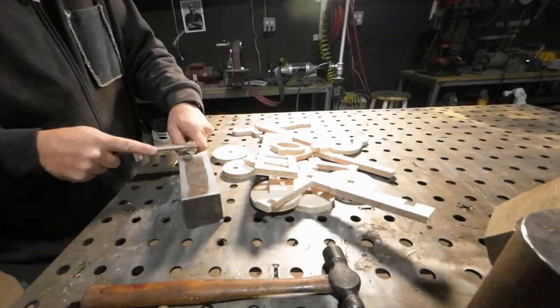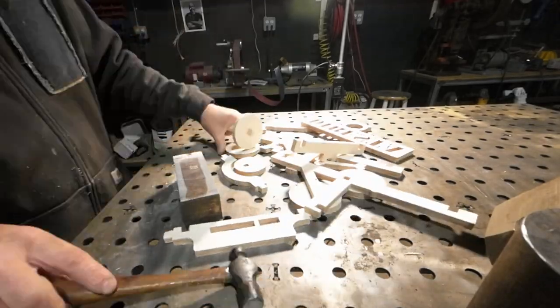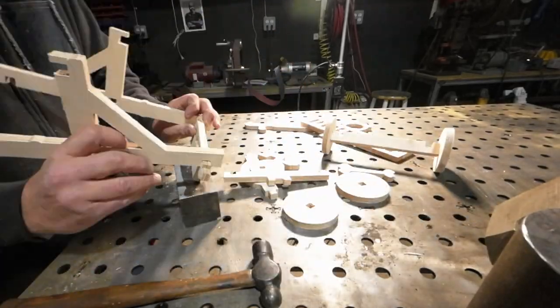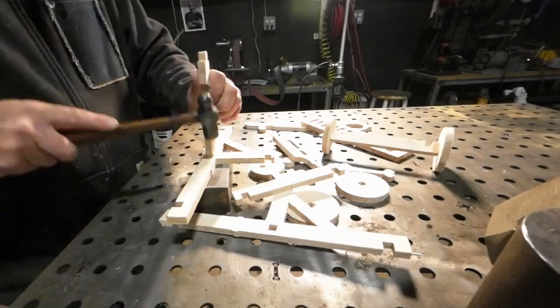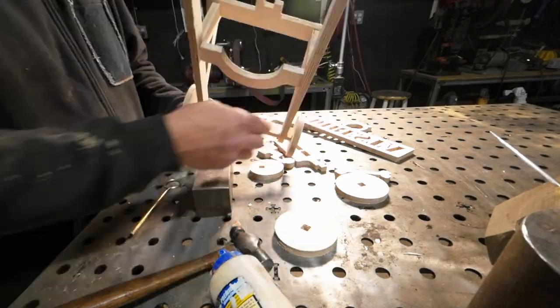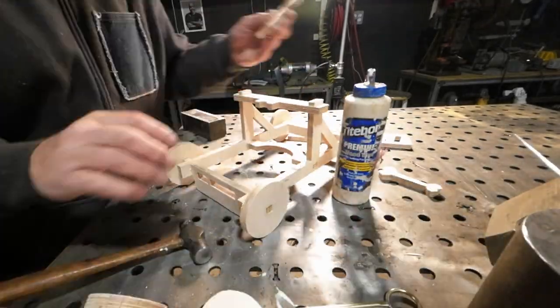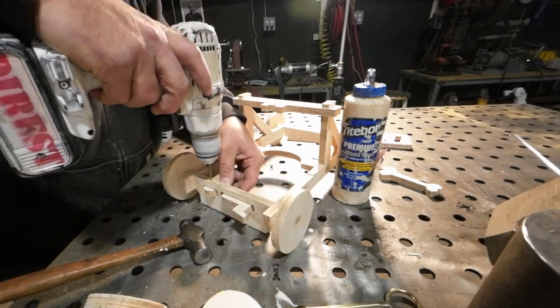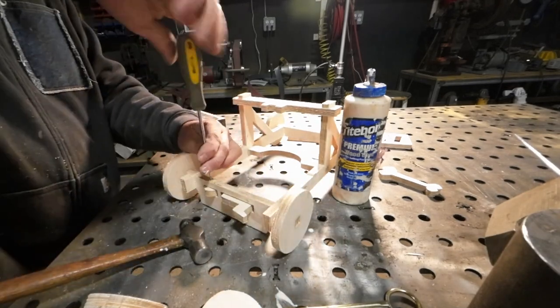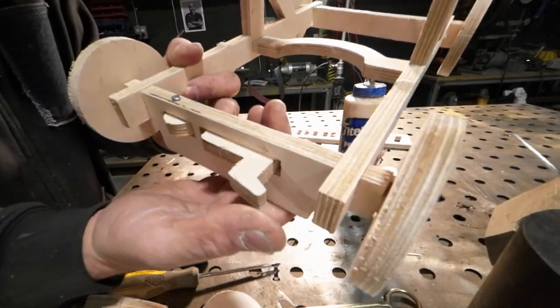And here we go. This is the assembly. What I'm doing primarily is just filing over any of the squares. I could dog bone it. That's where you see CNC furniture and whatnot sometimes has the little dimple at every interior joint, every interior angle. That's so that anything intersecting it with a square edge won't have to interfere with the kerf left by the curve of the blade. I tend to, there's the switch. It's working really well.